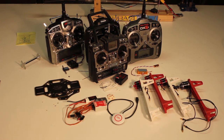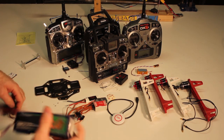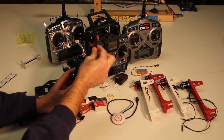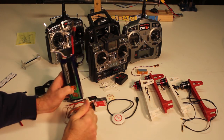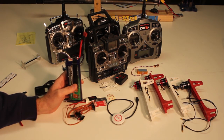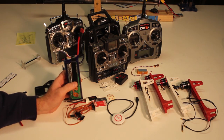You could use an F-550 or some other frames. But the main reason I proposed this group build to use the F-450 or the F-550 is that power distribution is built into the frame itself. If you're new to this, you might be saying, what's all this power distribution stuff? Power distribution is how you get power from the two wires coming out of the battery — the two main power wires — to all the motors.